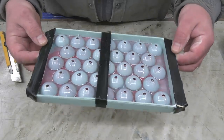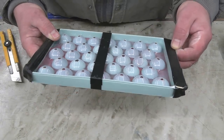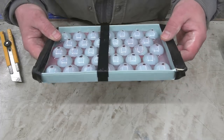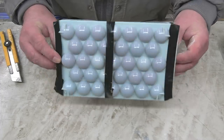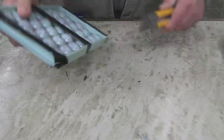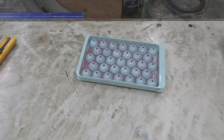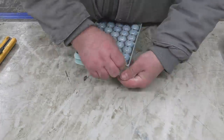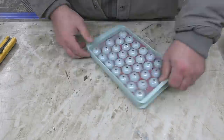So it's the next day and it looks like our levels have dropped off inside here. I don't know if it leaked internally or what the deal is. Let's tear this apart and see what we've got. There wasn't a lot of flashing on the inside of this mold, so that tells me it was air trapped inside the resin. That's why it's important to degas it before doing this method.